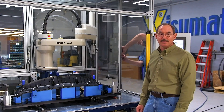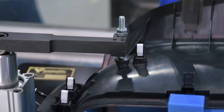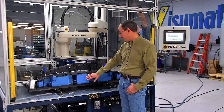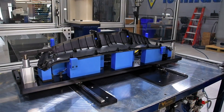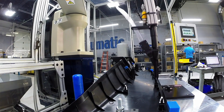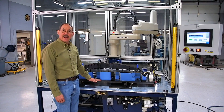This application we're installing clips on an automotive tailgate fascia assembly — this is a finished part on the lower side. You can see that we've got our fixture made out of non-mar material, and we've got part clamps that actuate when the cycle starts to hold and retain the part in position, making sure we've got good backing all along the plane where we'll be installing the clips.